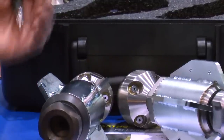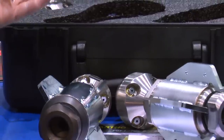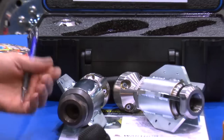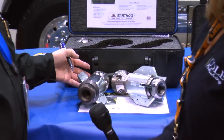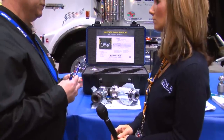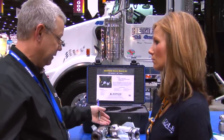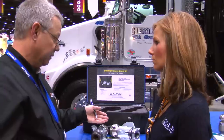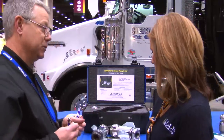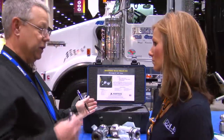It also allows longer runs so you'll be able to get the nozzle out to the impact point, clean and scour the pipe, and pull it back faster. The classic nozzle goes up the line a little bit slower — it will hit and concentrate on the root and pull it back nice and easy. The whole idea behind the new WGMP was more toward general purpose cleaning, to get the nozzle down the line for production and bring it back faster.